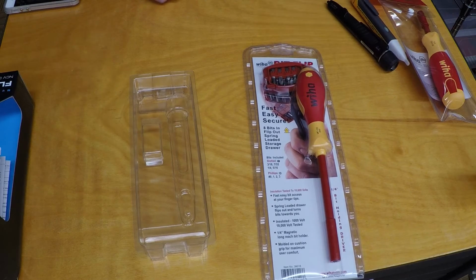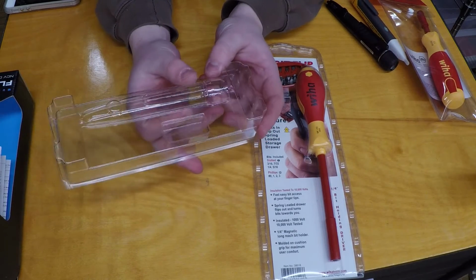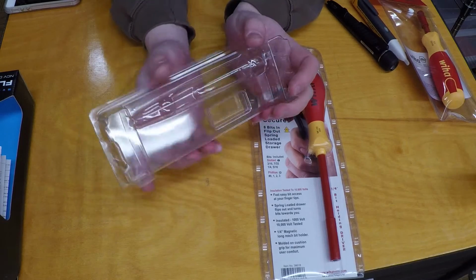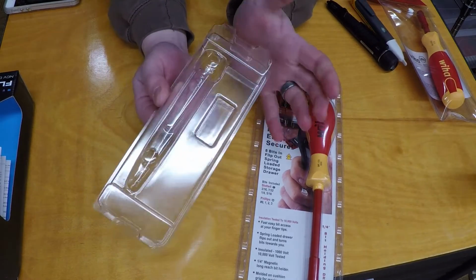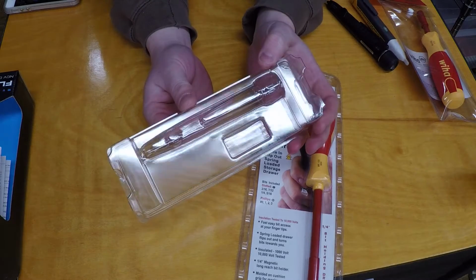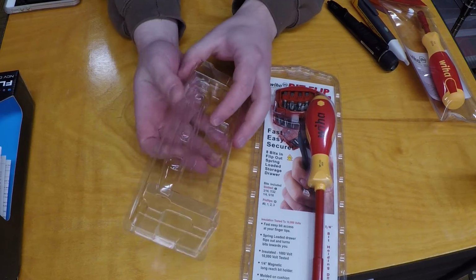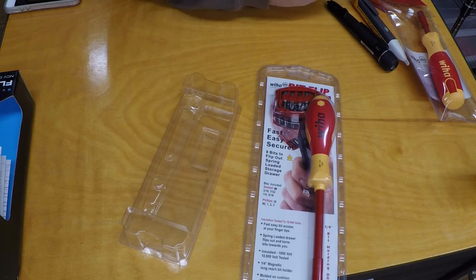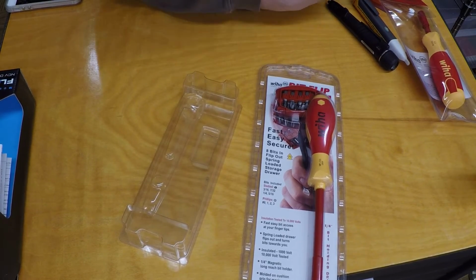And so you guys have a little bit of machining content. Thermoforming is a really interesting process, and it's a process that's used all the time. You may not have thought about it, but you'll see it all the time. This packaging is all thermoformed. Clamshell packaging, this is thermoformed. This plastic package, all the kind of stuff you see like this is thermoformed. And it's a very interesting process. It's dead simple. You take a sheet of plastic, you heat it until it sort of sags. You know, it's getting warm. You drape it over a mold, and you suck all that air out from the bottom side. I mean, there's other kinds where you suck it out and you apply pressure from the top, but generally thermoforming is just that. It's sucking the air out from the bottom of the mold.